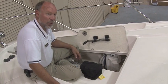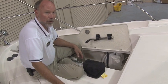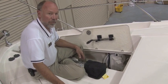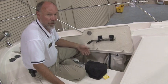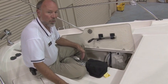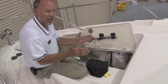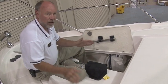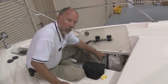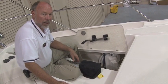You're probably wondering why I'm at the bow of this boat when we're talking about water systems. Well, this is just to remind you of a problem that will most likely occur. At some point in your boat's life, you're going to run it out of fresh water. Even when you refill it and restart the system, the pump is going to continue to run and cycle. What's happened is you've trapped air throughout the boat's water system. That air compresses, the pump turns off, and then as it recalibrates down, it turns back on — so it goes like brrr, brrr. To eliminate that problem, you need to bleed the water system. You always want to start at the farthest point from the water pump — that's why we've come to the bow — but you want to do each spigot on board to make sure you burp the air out of each and every one.